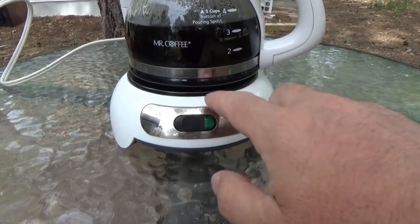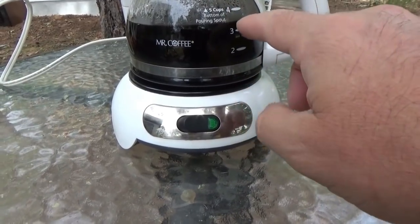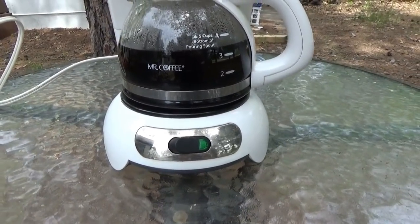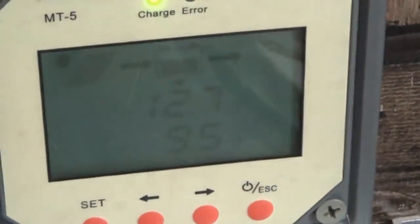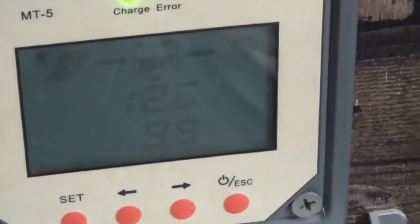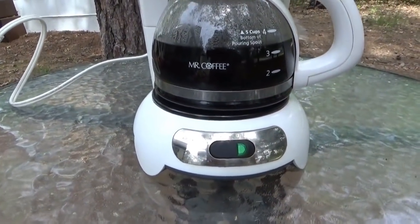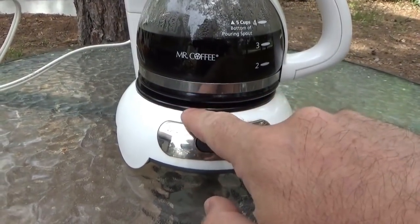The heater is still on — there is a plate heater down here. Let's go inside and see what we are looking like. I am letting the rest of that trickle out. Looks like I lose half a cup of coffee in the filter and the grinds on this. This is my first time using this honestly too — I didn't even know if it worked. We are still pulling 10 amps and it is coming up to 12.7 volts. I still have the coffee maker on, so I am going to kick that off and we will see what happens. I am going to shut this off, and the voltage should jump up tremendously now that the warming pad is off.